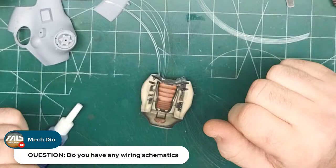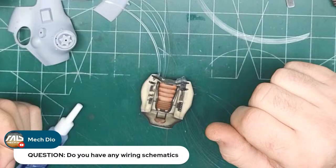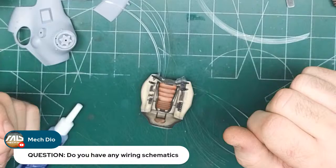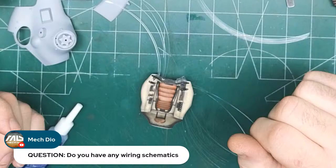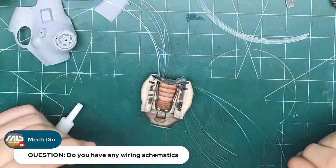So you could use 9 volts. It just depends. You could use 9 volts on anything. I mean, you're just going to use a massive resistor if you're using a low amount of LEDs. If you're only using like 3 LEDs or one LED, you could run it on 9 volts. You're just going to have to make sure you have the right resistor in there to take up most of that voltage, that most of that pressure, so you don't end up blowing it up.